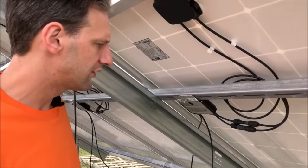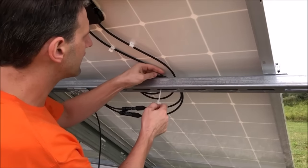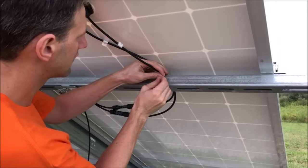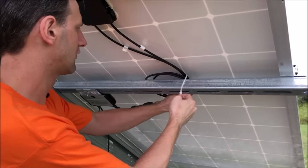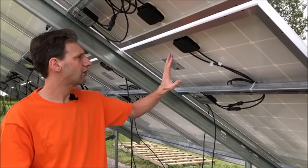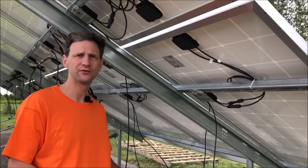And then what we can do is just take a zip tie, feed it through our channel, and secure it there so our wires are nice and neat. So let's go ahead and connect all of the solar panels to the optimizers, and then we'll come back and connect the optimizers in series.